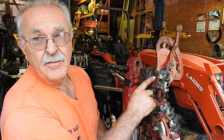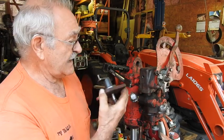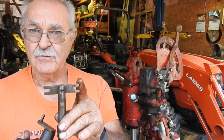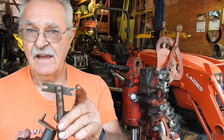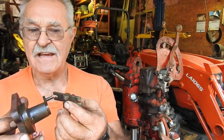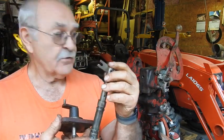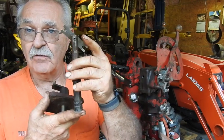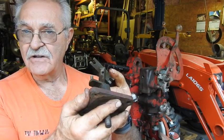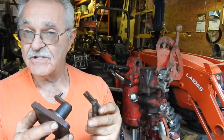Whenever I went to put this together, on this one component here we have this L-shaped little pin right here, and that pin actually inserts into the portion that attaches to the draft control, which happens to be this guy right here. The draft control will hook in on the left-hand side, and you can see how that pivots — this will go up and down whenever you move your quadrant lever. This guy right here is your quadrant lever, and it has to insert into this guy right here. Well, this is spring loaded, so whenever it's unpowered or in the static position, the spring's got it pushed all the way up to the top. With it all the way up to the top, at this angle, there is no way you can fit this guy in — no configuration whatsoever. Can't happen because of the machining — there's just not enough room.